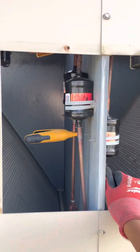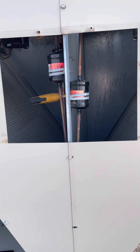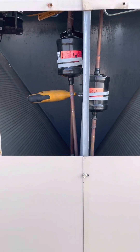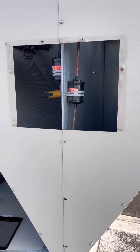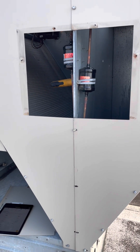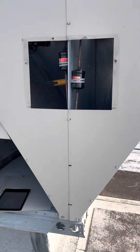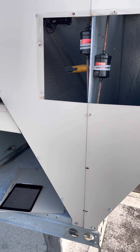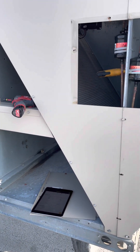That's pretty much the gist of it, guys — how you check for liquid line dryer restrictions. The most important thing is when you notice that your pressures seem off, you don't always want to just jump to the conclusion that the system needs refrigerant. There are other things that you can check, and of course we don't want to always condemn the TXV either.